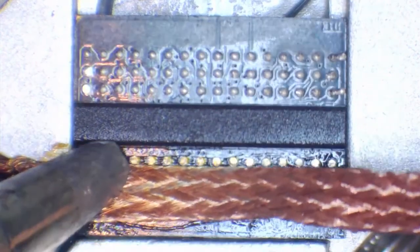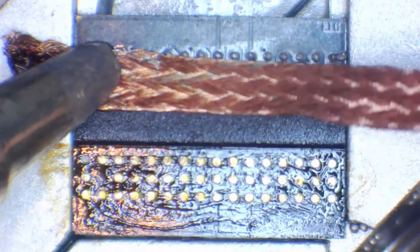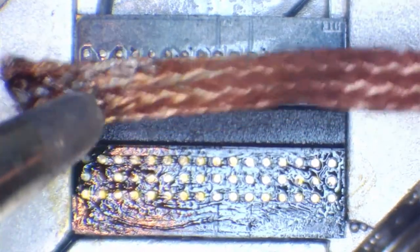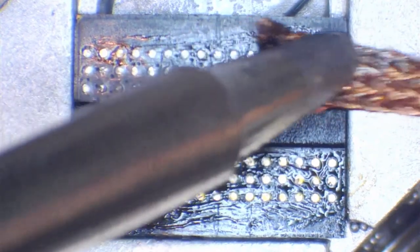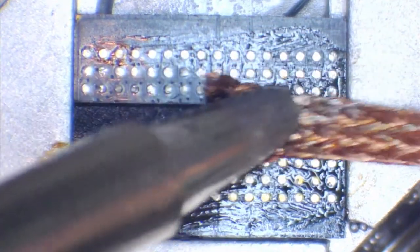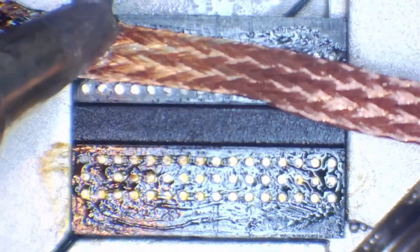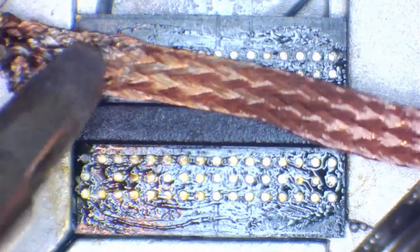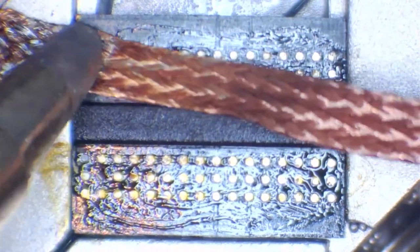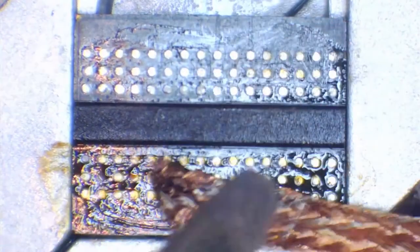You can see that this chip is probably a bad example because it's fairly unsteady inside the jig, because this is the tightest this jig will go. It's fairly unsteady, but we can still work with it. And this is going to apply to pretty much any chip. It doesn't matter what it comes from, where it comes from, or what size it is. This method applies to every single chip, regardless of size of the solder balls, size of pitch, size of the chip and how many balls there are. You can do any chip by hand without the stencil.